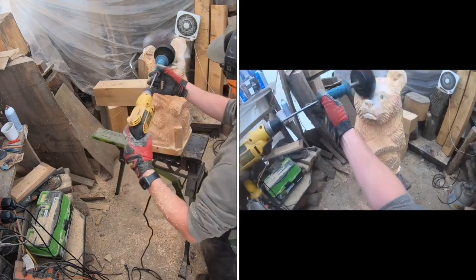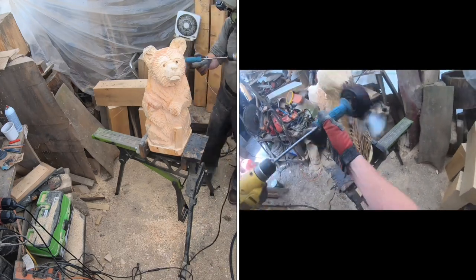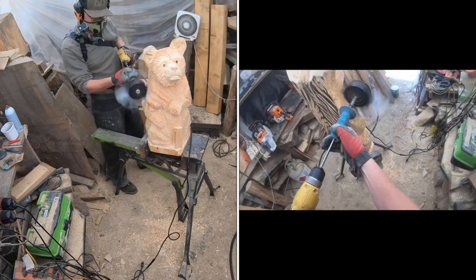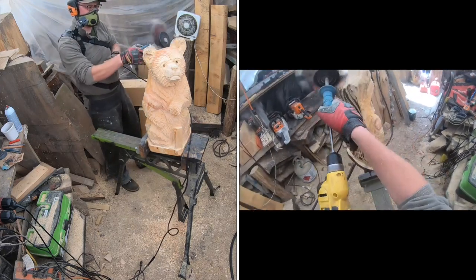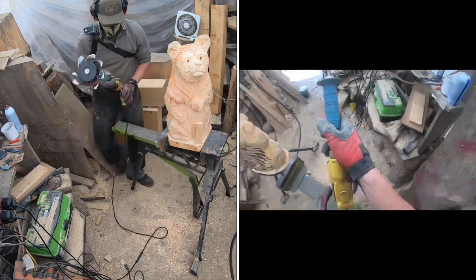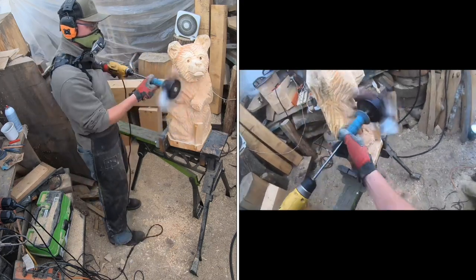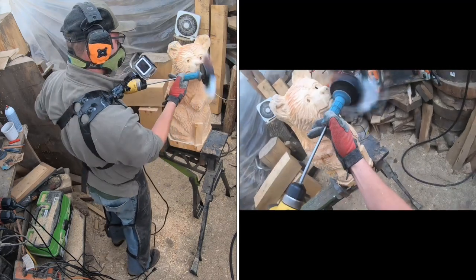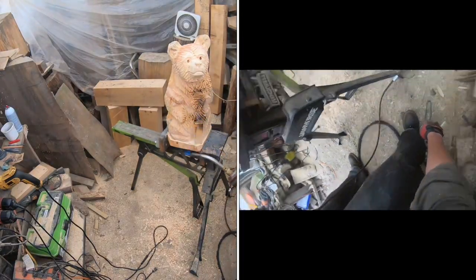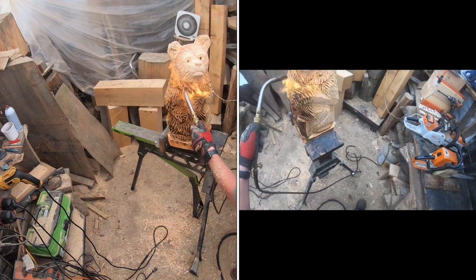Once you've got your face done, we're moving into the flap sander. I've got my extension and Sandoflex going. I'm going to get two of these extensions on the Etsy store this weekend — link in the description. I try to always have the sander sanding upwards as I work around the carving, rather than flipping the handle so it sands down. Get done with that, then go around and hit everything with the torch — torch the whole thing.